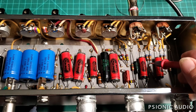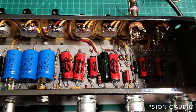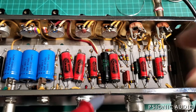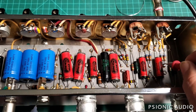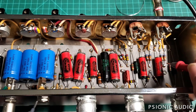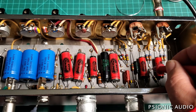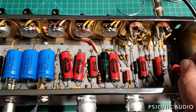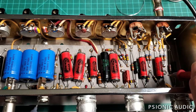On channel two we've got 68 millivolts there, and on channel one, 259 millivolts. Now the board had a lot more leakage than that. I can measure that same 60 on the board here, and 200 on the board right next to this eyelet. It's actually not here — it's over here where these wires are going through the board.